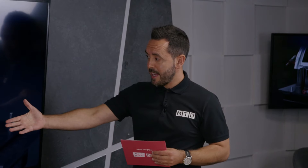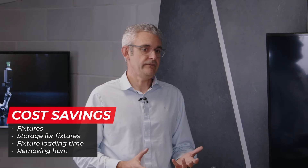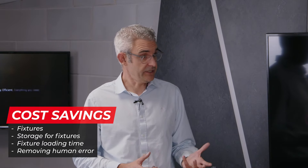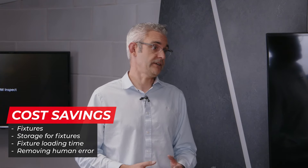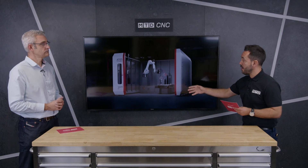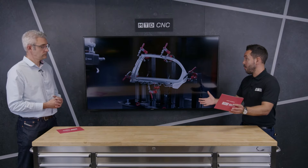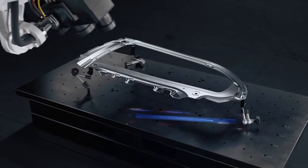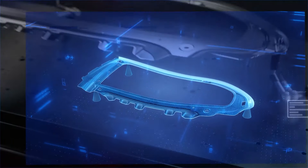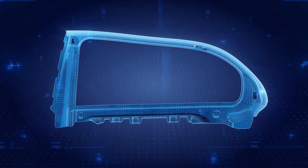So effectively it's eradicating dedicated fixtures such as what we've just seen, with just three mechanical universal fixtures. The direct cost savings are the costs associated with dedicated fixtures, but they don't stop there — fixtures need to be stored, so there may be associated costs for storage space and calibration. These virtual clamps, put onto your machine bed, can stay there permanently and accommodate all types of componentry, regardless of size within the working envelope. As part of the process we capture the position of those connecting points, so if we need to move them for different shapes and sizes of parts, we can compensate for any gravity-based distortion and virtually apply the effects of constraining that component.